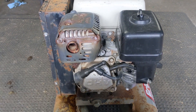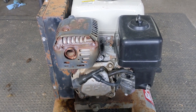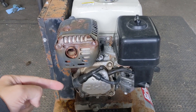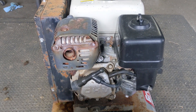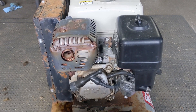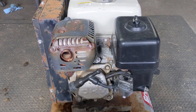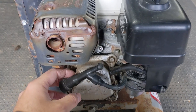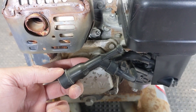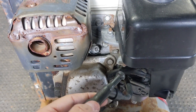However, these wheelbarrow compressors are used by roofers and they take a beating. These guys pretty much run them until they just won't start anymore and then bring them to me. The roofers usually leave these in the back of their trucks, fire them up, and run their airlines right from the compressor sitting in the truck bed. As you can imagine, it's going to rain and this thing is out in the elements — sometimes working up to seven days a week in all kinds of climate conditions. These spark plug caps end up getting too much resistance in them, which weakens the electrical current going from your coil to your spark plug.